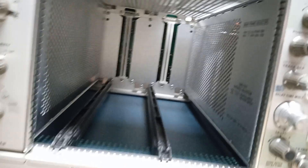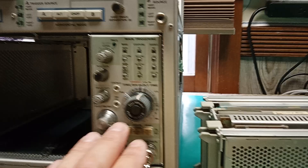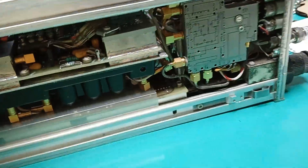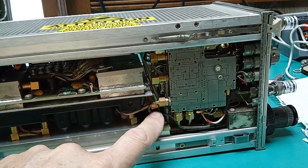You can see back in there the edge card sockets. Slide these units back in slow and careful. When they touch, push gently and evenly on the frame — don't push on controls, and it'll go back in and click. If it doesn't click, it can fall out. Don't mess with or bend these hard lines.